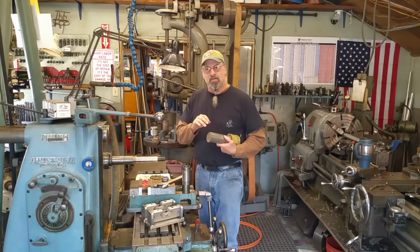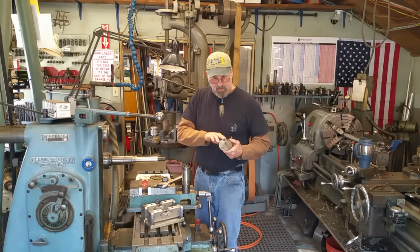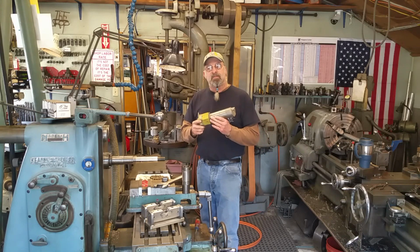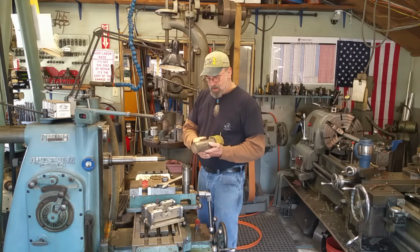The stress riser areas on shafting can be 100%. This actually was radiused down here. It was rolled over on the top. It had a spoon keyway, and yet it still broke off, and that was because it wasn't fit up right. But we're not here to talk about or place blame on this here.